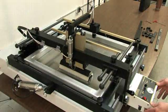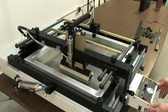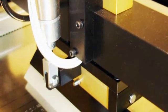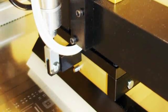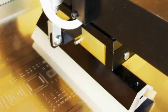Our semi-automatic and automatic models come with an adjustable power sweep squeegee for printing with single or dual stroke. A dual squeegee holder for urethane or metal squeegees allows for independent print force adjustment for the clean, convenient application of solder paste.